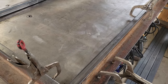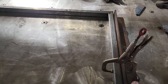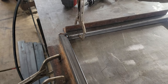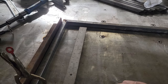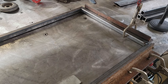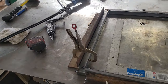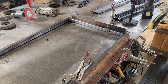Number two, if you want to build it square on the cheap, get some angle iron and make a box for your square, if it's going to be a repeatable thing. What I do is take my steel framing square and check it with a machinist square to make sure it's square and true. Check your square, check your box, taste the soup as you work, if that makes sense, so it will be square at the end of the day. You're never too old to learn something.